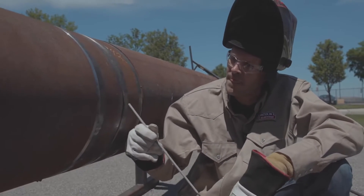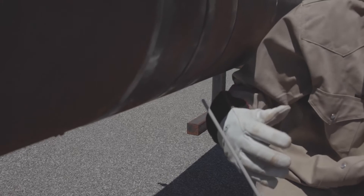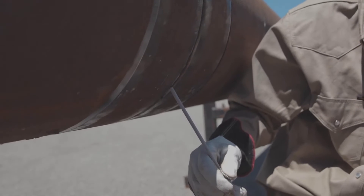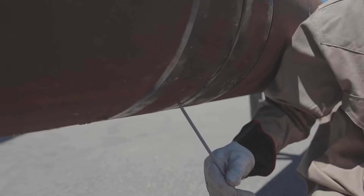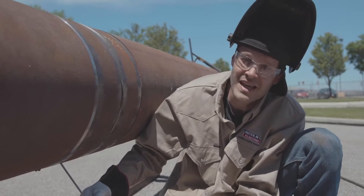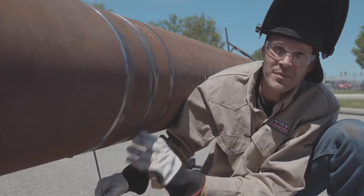So if you watched the other video, we have a pretty good rod angle coming down the side and now we're coming straight in. The transition I like to use — and that is successful — is keeping a similar rod angle as you come across the bottom. I have a little bit of a drag, keeping the same rod angle, although the pipe changes and now I end up into a push. So I'm going to push across the bottom. A big thing I'm looking for is buckshot coming out — if your rod angle is not right, you're going to get a lot of buckshot and spatter coming down on you.